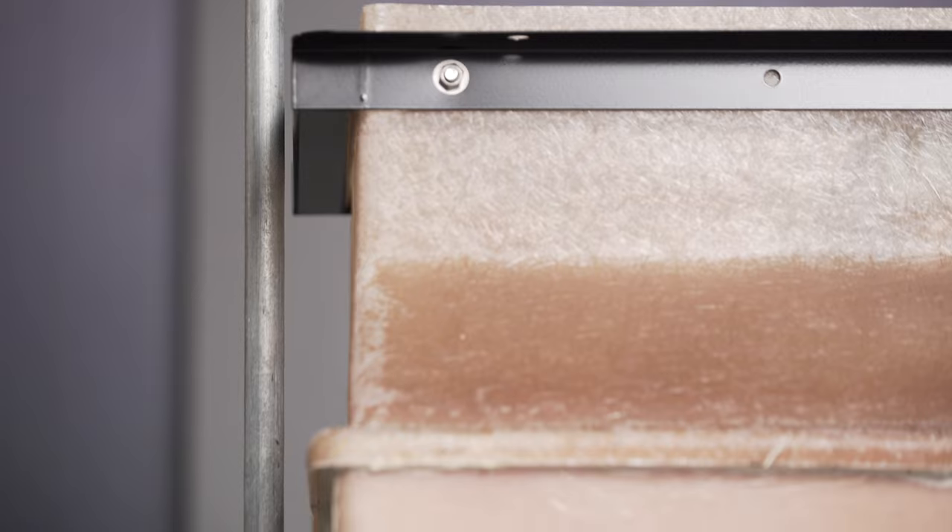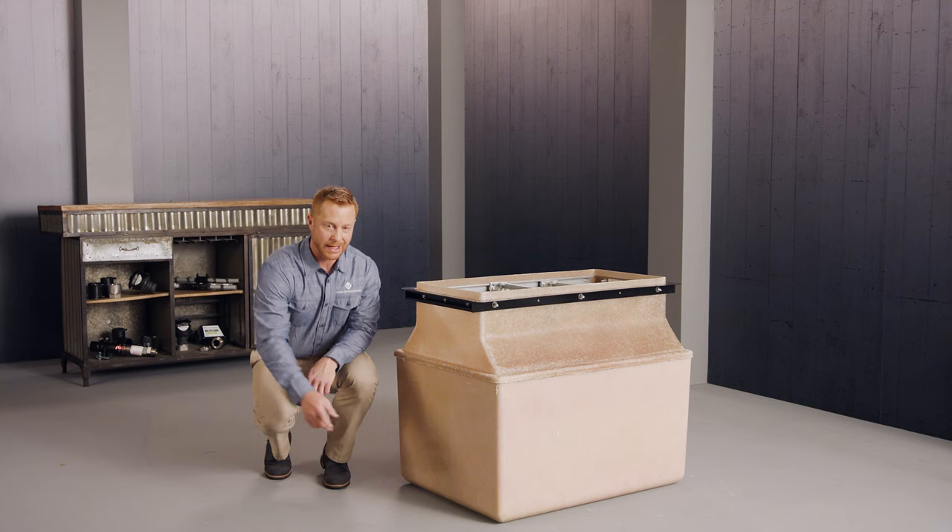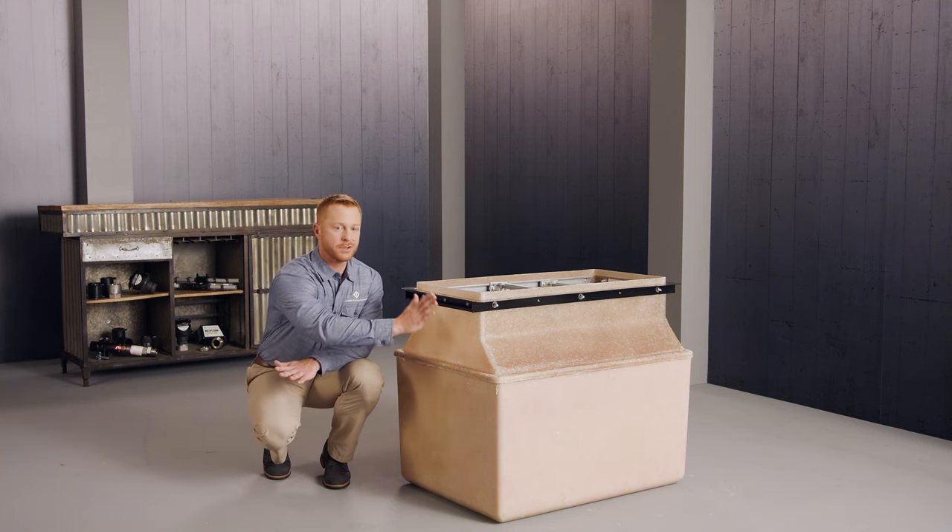Why that's important is when the electrical installers bring their electrical conduit up next to the containment and bend it up towards this unistrut, they don't want any obstructions in this space. So they have a nice clear single bend movement up to this point of the unistrut where they can seal off and install their electrical entries into the dispenser.